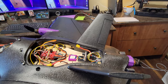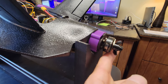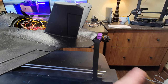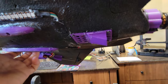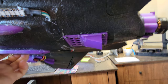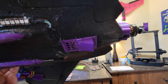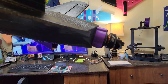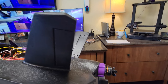I put an old prop with the blades snipped off and just the nut on there — that's to protect the motor in case it comes down hard on the ground, since I street-land. I also have this little vent cover on the ESC — it's not really there to add cooling, it's there as a skid. It keeps the ESC off the ground and out of grass, dirt, or mud, and helps prevent the back from hitting the ground and touching the motor bell.